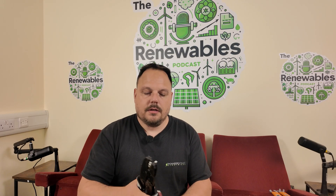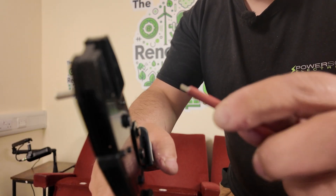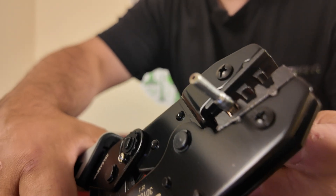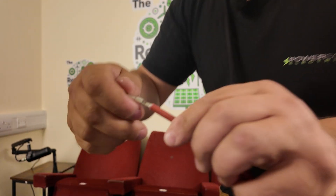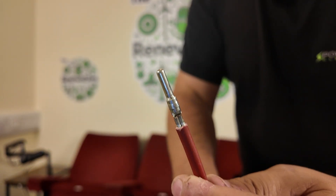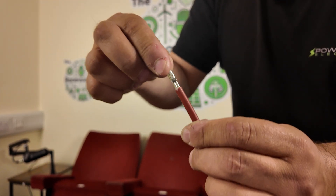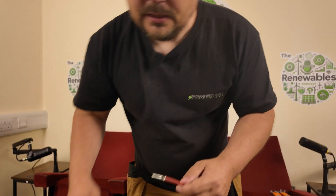With the crimp itself, I've held it in on the 6mm crimp. We need to push the cable in the back of the crimp body, then squeeze and crimp — and we should have a solid crimp connection. There's no pull on it and the strands stop at the end of the crimp body. One mistake people make with MC4s is to push the strands too far into the crimp — with females especially, if you go too far you can impede how it all puts together.